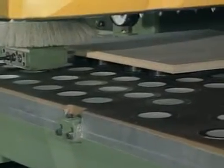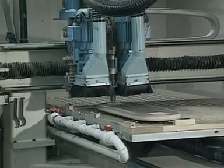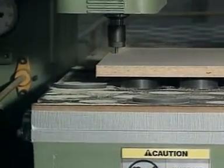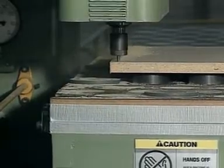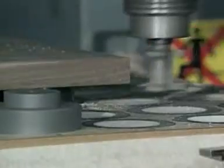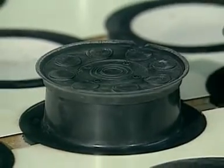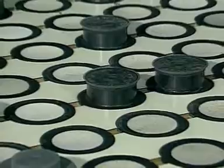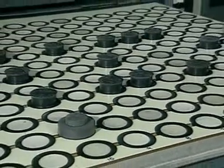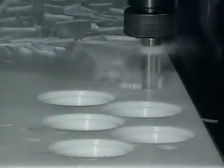The Carter Flip Pod vacuum piece part holding system directs vacuum power exactly where it's needed to hold parts in place for machine processing. The system is based on a grid of cavities fitted into the surface on which parts are placed. By controlling the air passing through these cavities, vacuum can be maintained precisely in any areas desired without using time-wasting spoil boards. This control is accomplished with the special pod elements shown here, which fit securely into the gridded surface known as the pod panel.